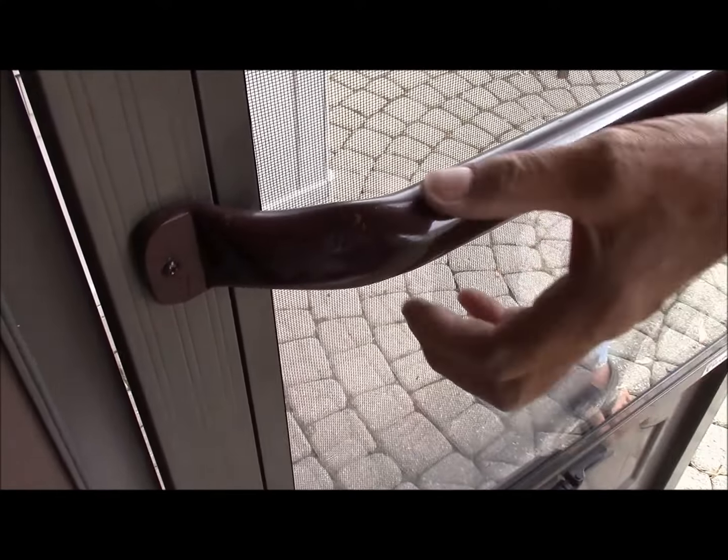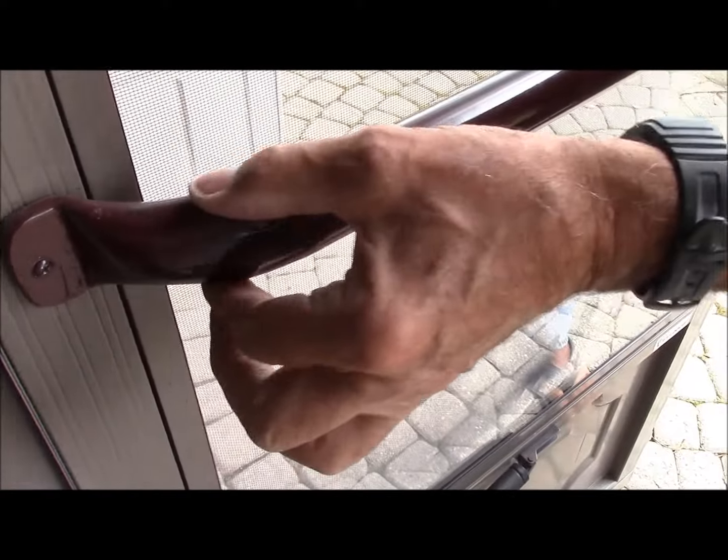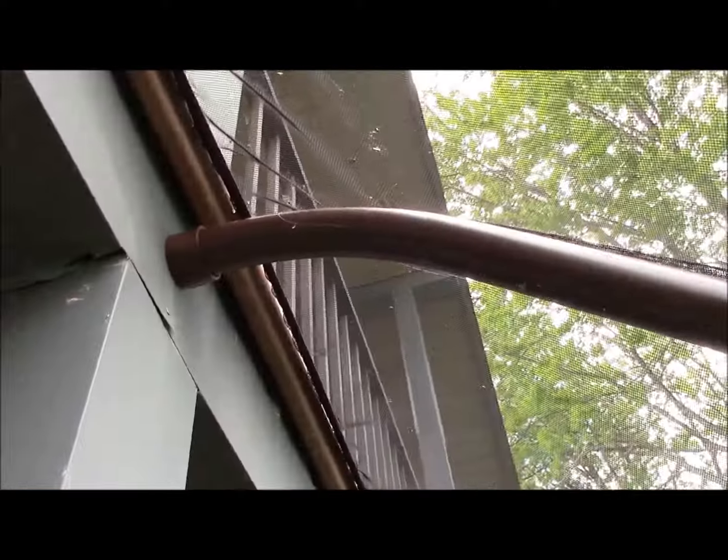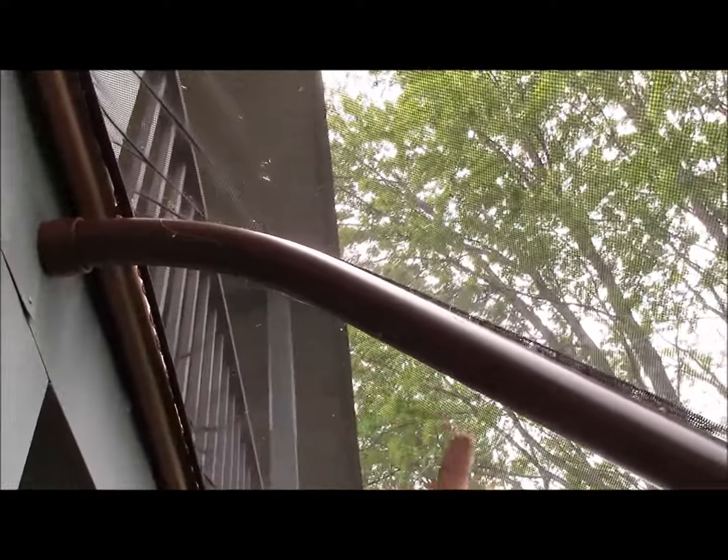He didn't bend this. You can see there is a little kink in this piece, but it's a push bar for my screen door. For more strength, I heat and bend 1¼ inch PVC. And again, to prevent compromising the PVC, I cut my fittings to go around the pipe. So my rib can be one piece, which makes it much stronger than if I cut it and installed the tee.